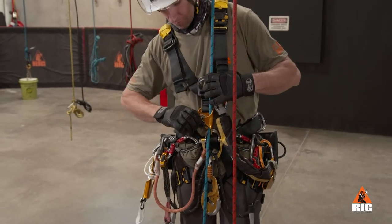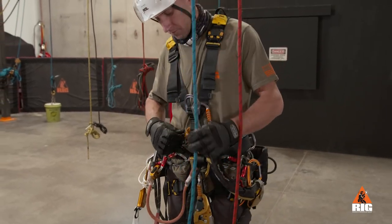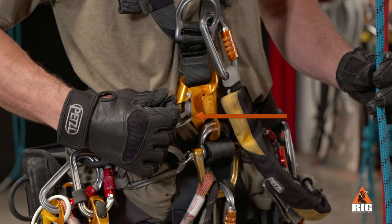To remove the rope, slide the device upwards on the rope while operating the safety catch to disengage the cam. Close the cam when not in use, as equipment or other objects can jam in the rope channel or snag the toothed cam if left open.